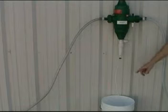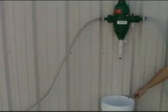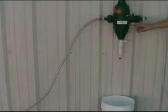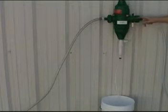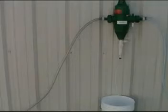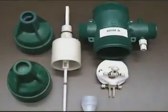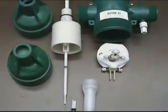As water is flowing, chemical is then drawn up from the chemical container by the chemical pump, bypasses around the water motor section through the pressure tube, and mixes with the water in the large 2-inch pipe mixing chamber at the outlet of the water motor. The Gator is constructed in modular form so that each component can be easily replaced.